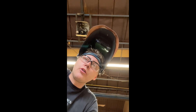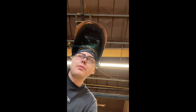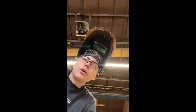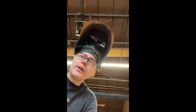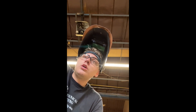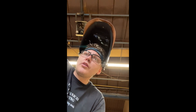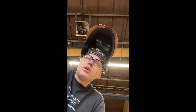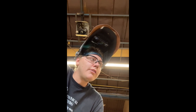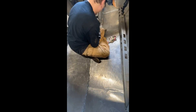Basically what I'm going to do now is do a pretty good thorough cleaning around the intake on the base material and on the actual machine faces itself, just because aluminum does create a scale after a certain amount of time and you've got to make sure you get that off or you get really black gross looking welds. Not only that, it makes it harder to weld and it doesn't like to accept the filler material as well. The actual print says to use a 4000 series wire, so I'm actually running 4043 aluminum wire. It seemed to be welding pretty good when I did my test sample. So basically now what we'll do is do a good cleaning, make sure I got my ventilation system on because I am in a boat and I don't want to fill up full of argon and have a hard time breathing, and get ready to go.